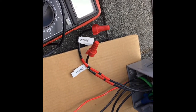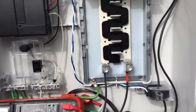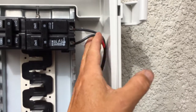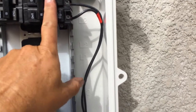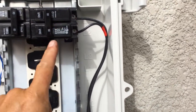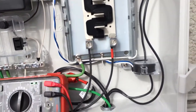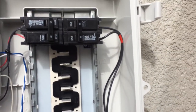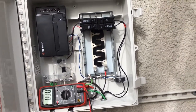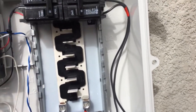I'm downstairs now. I've capped the wires that were running to the roof. This is the Enphase combiner box and the 15-amp breaker that's been tripping. I think I found the problem. Here are the wires heating up the bus — these wires go to the AC disconnect. I've removed the Enphase wire that had the nick in it and I'm just testing the remaining wiring to see if it blows the breaker.